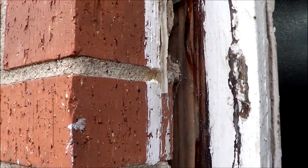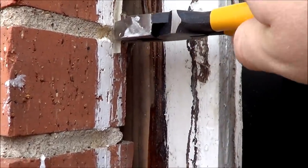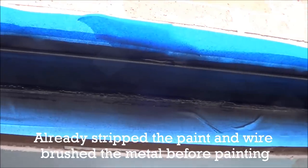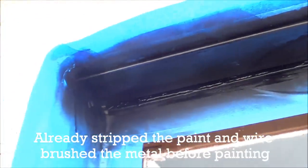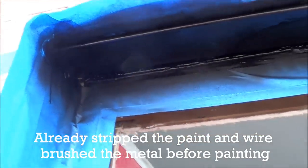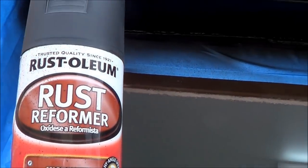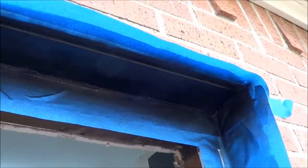For the caulk that's built up over the years, I just take it with some pliers and pull it — it just breaks off real easy. For the metal piece that holds up the brick along the top of the window, I've used some spray paint — this is rust reformer — to prevent rust from coming back. We'll just leave this black and let it dry.